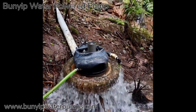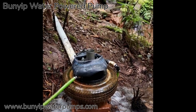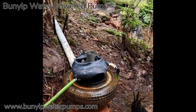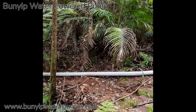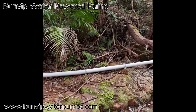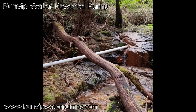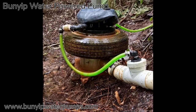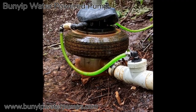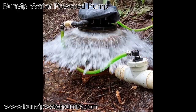This particular pump is running on about a 1.7 metre fall in the river, and it's only pumping to 32 metres in this case. Running on about a bit over 3 litres a second from the stream. This pump, if it was running full on all the time instead of self-regulating, would be pumping over 12,000 litres a day. But due to the lower flow it's running on, we're looking at more like 6,000 litres a day, which is around 4 litres a minute.